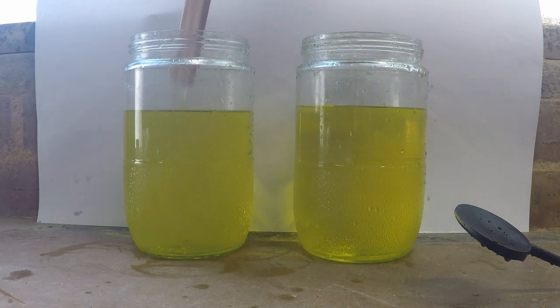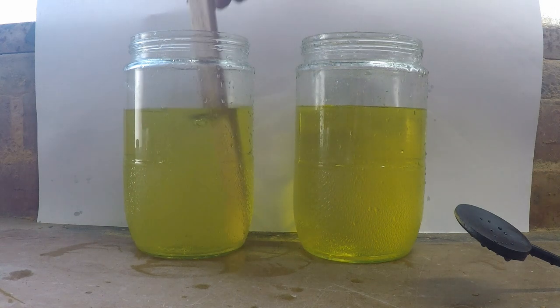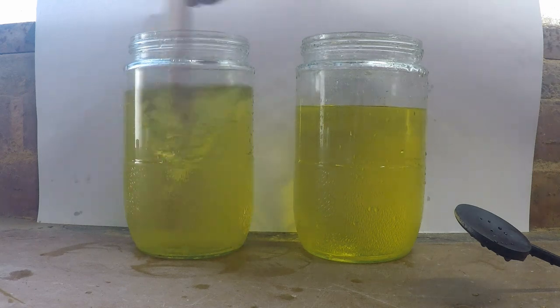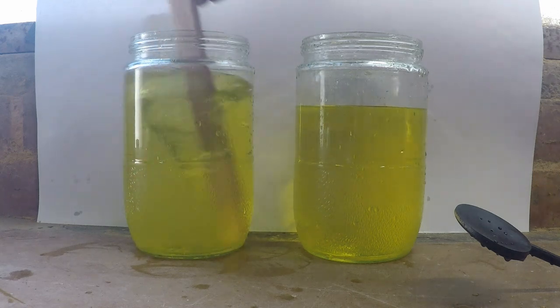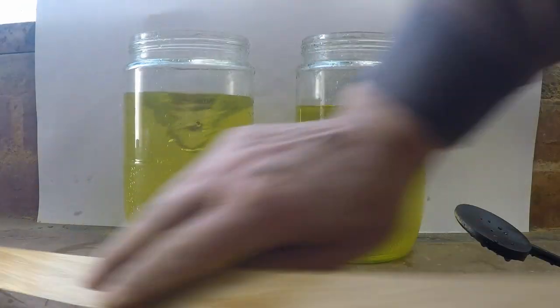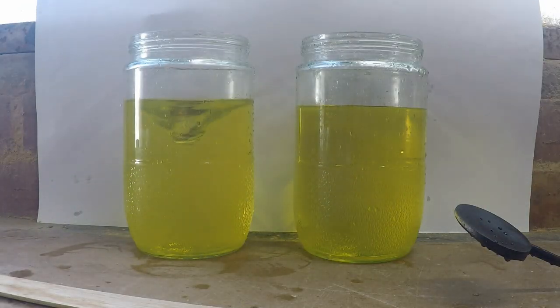So if you insist on doing it the wrong way, you don't need to do it like this — I mean, you can see the air being pulled in there. That's extremely bad. Always just use the gentle up and down. Always when handling your metal, be as gentle as you can. Don't break the surface. Don't mix air into it.